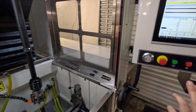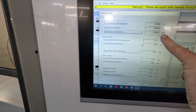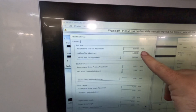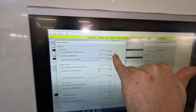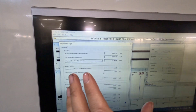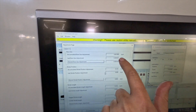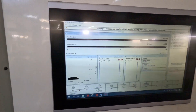I want to show you — when we make a bore comp, this is what we just entered, this is the previous bore comp, and this is our total bore comp. It accumulates everything so we know from where we snugged it — which is when the hone head expands into the cylinder — so it knows how big the cylinder is. From there we've added a thou nine tenths, and you can still see where we're going and where we need to get to.